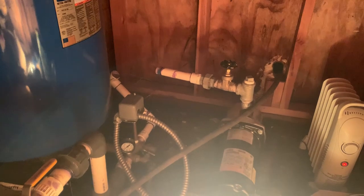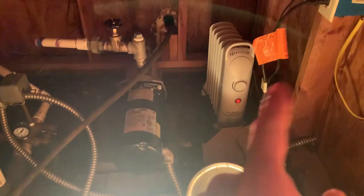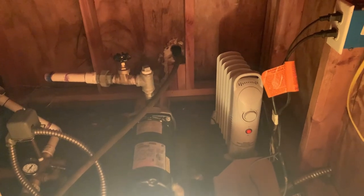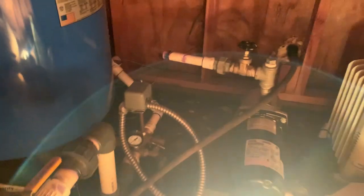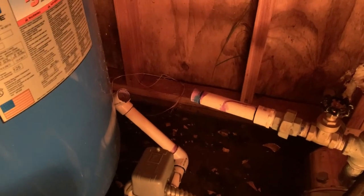So I thought that was going to be an easy fix. I replaced the piping, which as you can see has clearly failed, and added a heater to keep it warm. While it has gotten freezing over the last couple of nights, I don't think it was frost that got this. I think this is just a bad glue joint on my behalf. You can see the primer, which is purple at one end, but the adhesive — the cement — is not making good contact there. So I think I can fix that.